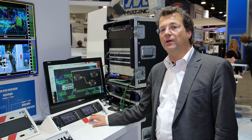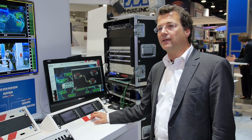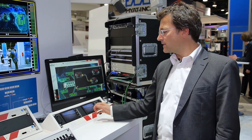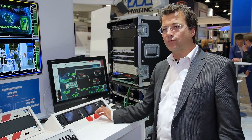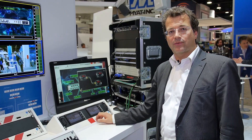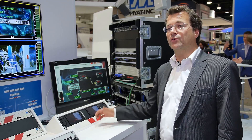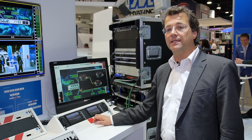The LINK4 is able to accept four SDI inputs at 3G, send out four SDI signals at 3G, and stream these video signals in different formats. The first format is simply RAW on two 10 gigabit outputs. The second is DirectPro, the third is J2K, and for monitoring applications we also have Motion JPEG streaming and H.264 streaming for mobile devices or internet streaming.